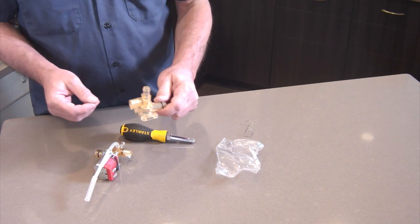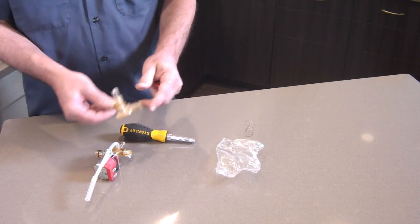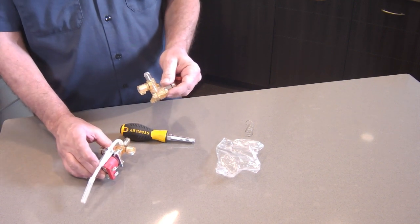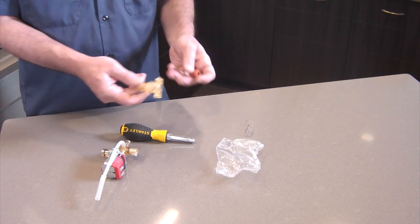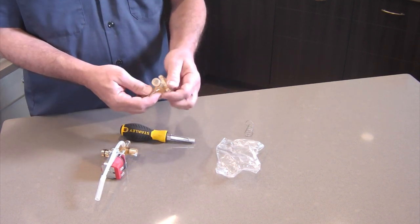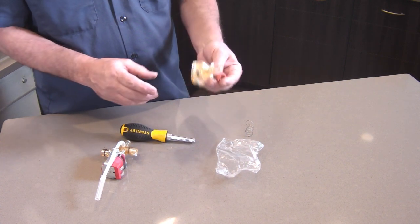And the reason we replaced this whole plastic piece is that we found that sometimes when you're removing this and putting it back on, since this is right up against hot water all the time, they sometimes crack, and then you're stuck with the machine down just because during the PM one of your parts cracked. So replace that whole body.